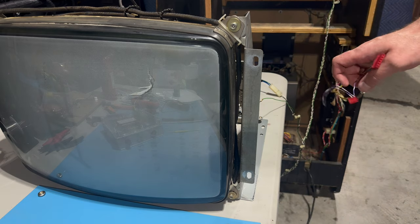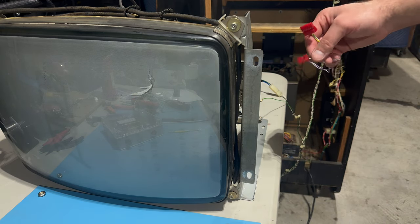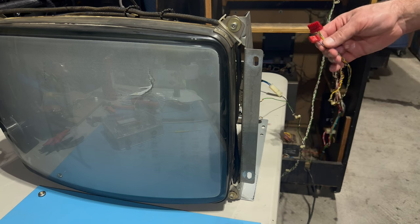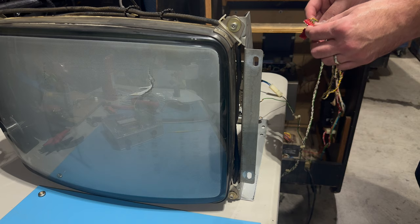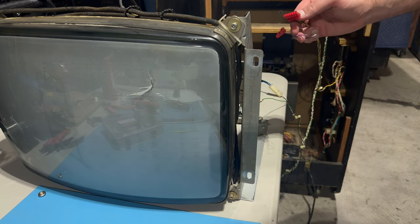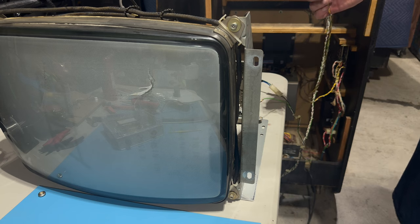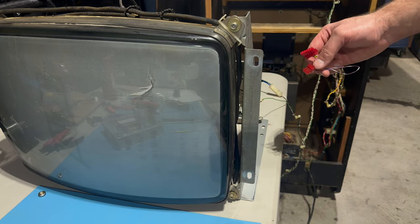the Matsushita monitor wants, the horizontal and vertical sync signals connected together. You see there's only one wire coming in and then it jumps over, so it's looped. But if I plug this in directly, I really only get red, green, blue, and ground on this main connector. And the 6-pin connector takes up the entire input header on the monitor, and there's nowhere to tie the sync in.